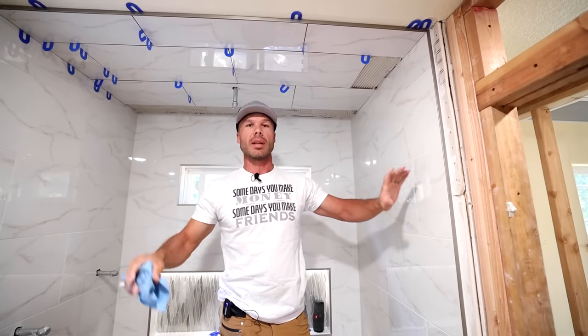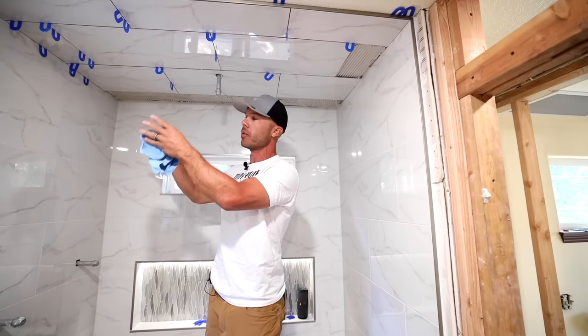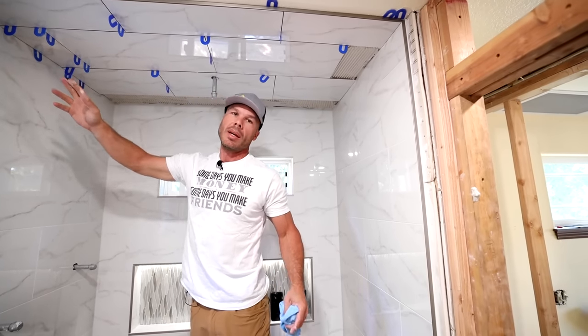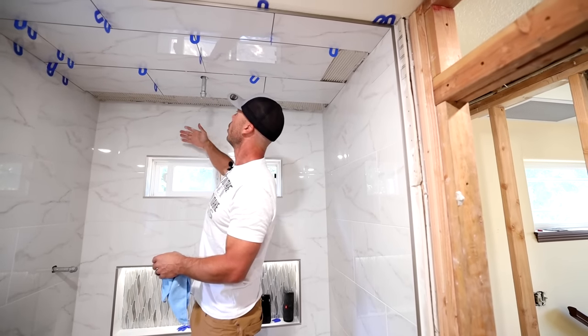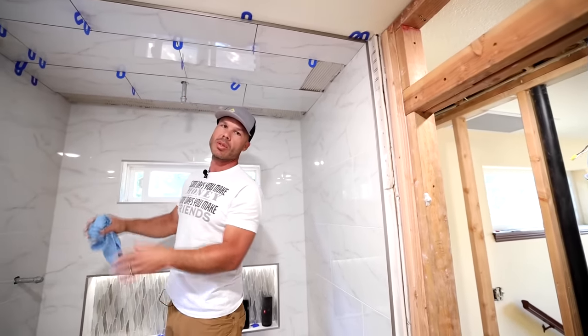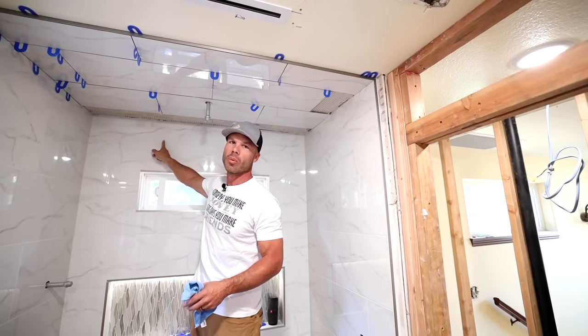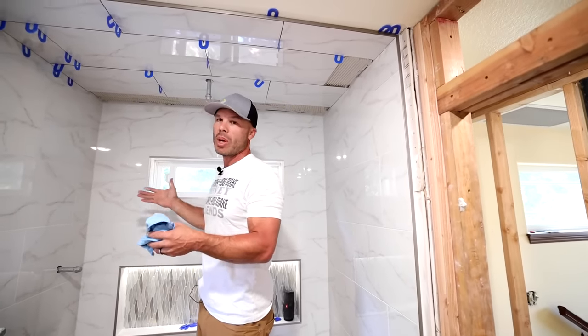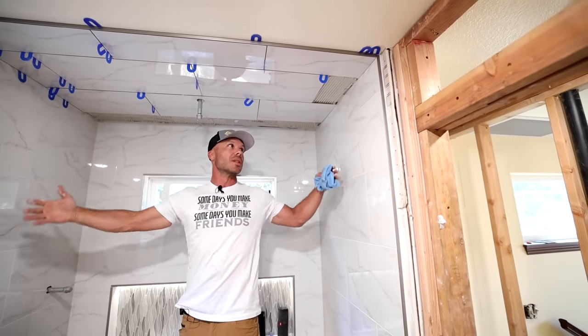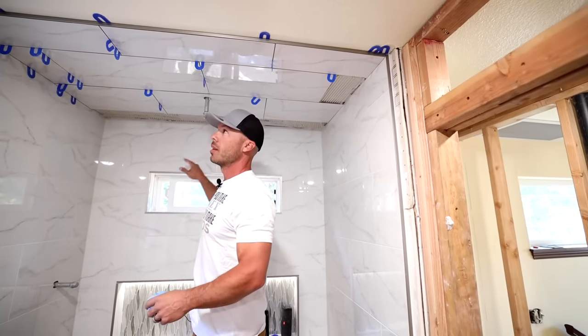You can see there are a couple of ways we can go with the layout when doing a ceiling. Unfortunately, two tiles sideways is shorter than one tile the long way, so we couldn't have all of the joints line up — it's about a quarter inch difference. So what we ended up doing is running the tiles this way so it flows with the back wall and lines up with the tile going lengthwise, but it's not going to line up going this way. Sometimes you can get it perfect and line up everything. This joint here is lined up with the wall joint. I think it looks best to have the wall wrap up and over, as opposed to the side walls, but it can be done either way — that's a layout design question that's subjective to what you want.